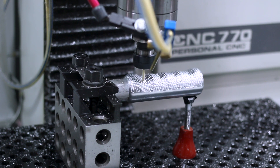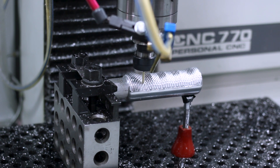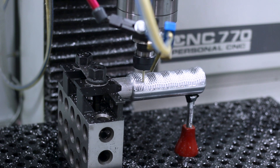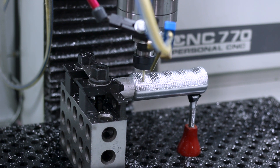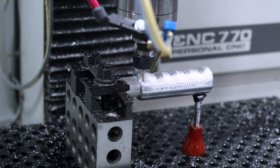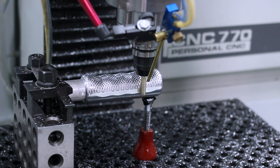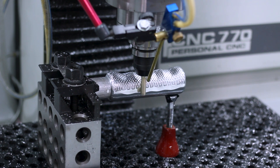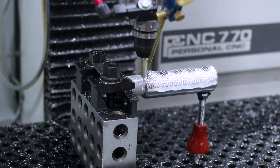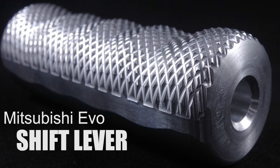It's awesome because it's just that easy, and you can do this on complex 3D shapes as well as simple 2D flat or beveled surfaces to get a really nice look and help with actual functionality and grip. Before we were done, we used an end mill just to clean up the sides and blend it in. The one weakness I'd note is it doesn't have a perfect blend — you could do better with a simultaneous fourth axis — but it's a much more interesting work holding example to show this being made on a traditional 3-axis machine. Hope you've learned something. See you next Wednesday.